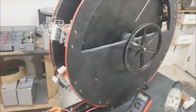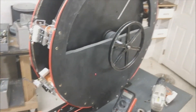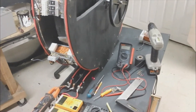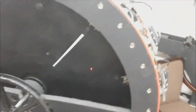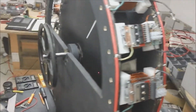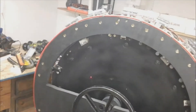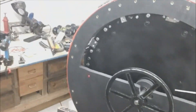It's a good opportunity to fix that slight skew. It's going to take me a little bit to rework this. I was hoping to get on the generator — I've got a bunch of parts made and could probably have it together in a couple days of solid work — but the motor's got to be right first. Everything else is good, no issues with any of the components. The operation is fine, just drawing too much amps. The spacing is not 22.5 degrees, and I think that's really the problem. For now, this is Technomancer for Zero Point Fuel, signing out.